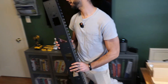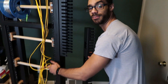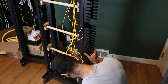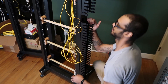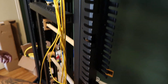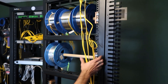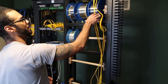We're going to be adding the second one. Always make sure and inspect that no cables are in the way before you install anything. First notch in, aligned with the second, and push down. And there we have it. These are the two vertical managers that are completely installed at this point, just without the cover, and we're slowly going to start bringing in our patch cables into the vertical manager.